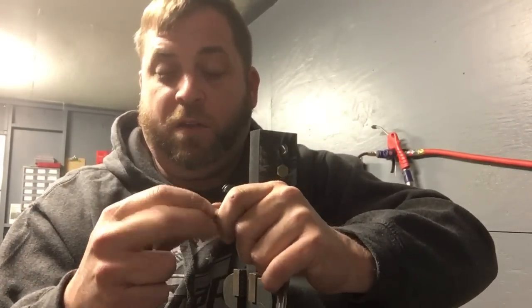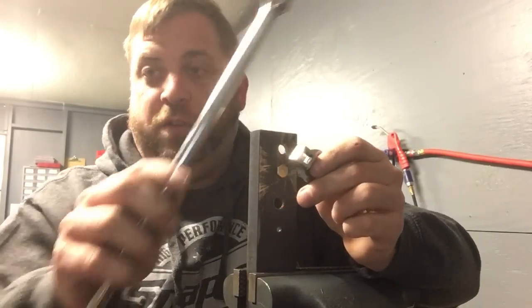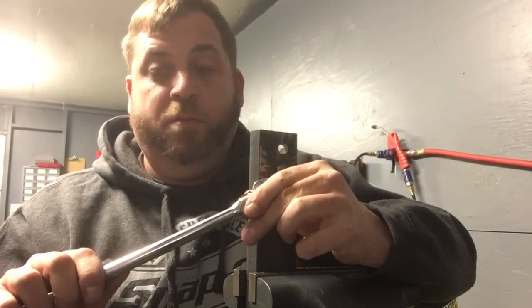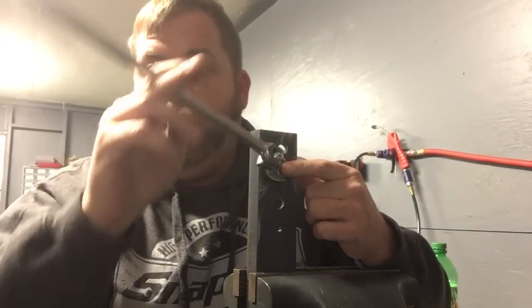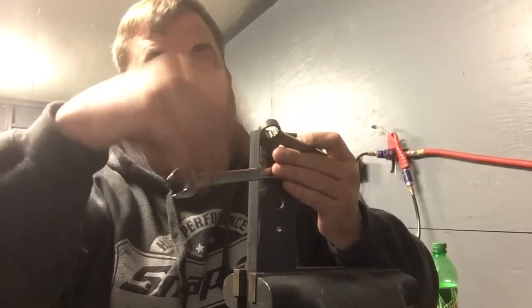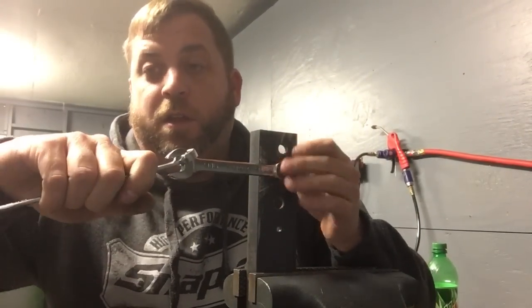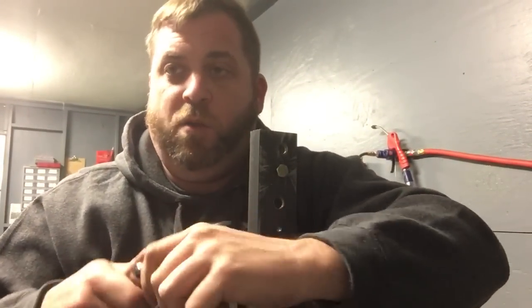A lot of people don't know they make these little accessories — they come in a set and can go either direction. Also, if you've got room but the bolt is really tight, you can take your breaker bar, put it on the crow's foot, and now you have a really long lever to break the bolt loose. You don't need two wrenches end-to-end, which gets long and in the way. That's another big advantage of crow's feet.